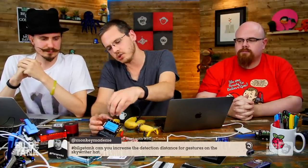And we added capacitive touch. So there's my capacitive touch banana. Trigger. Boom. Boom. And we've got croc clip pads down one side, so that's a bit like a Makey Makey. You can do fruit pianos and that kind of thing. We added another four capacitive touch pads on the front, just as standard inputs, so that you could build basic interfaces. And then, to top it off, we figured we could fit a breadboard on top. So we put a mini breadboard on top, and that means you can actually build your project on top of the hat as well.